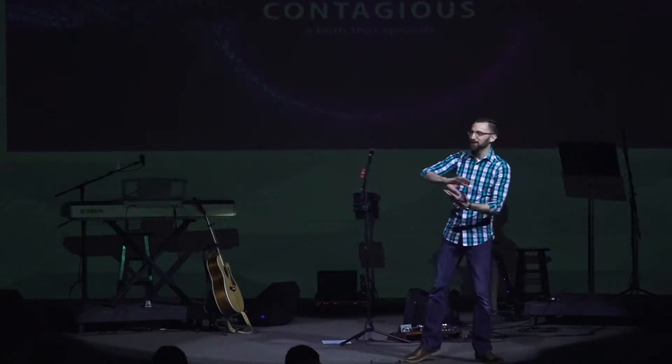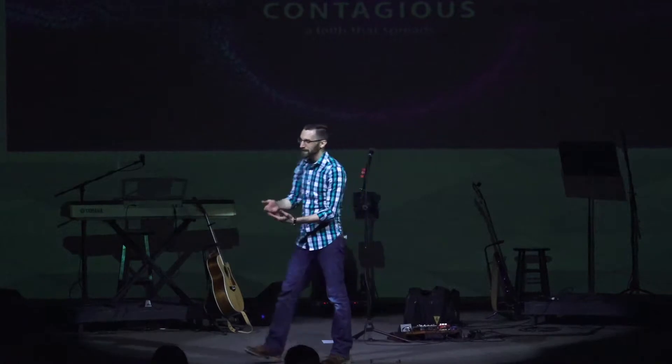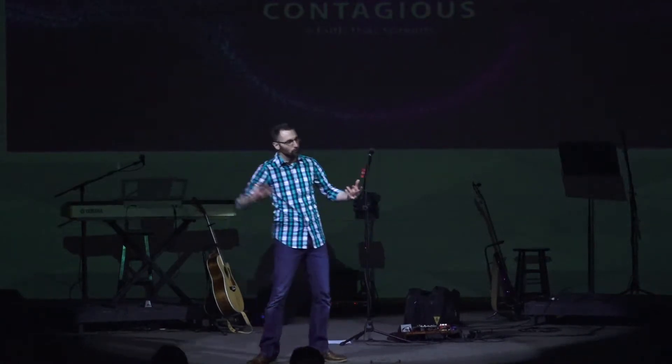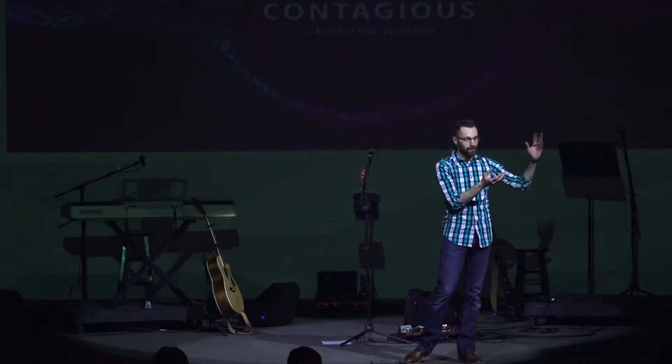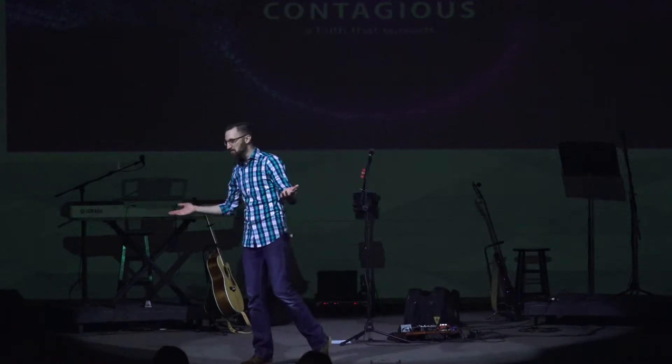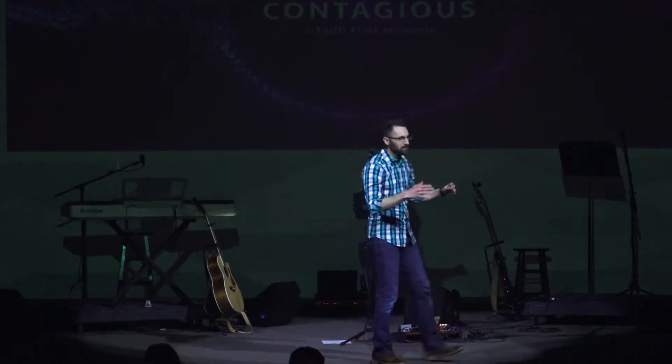I started to spin it, and it just wouldn't thread. It wouldn't go in. So I started looking. It turns out the shoe underneath my tub that the drain screws into was a super old brass thing that none of the standard plugs today are going to screw into. So I had to change the shoe. Not a big deal — done it before. We can do it again.